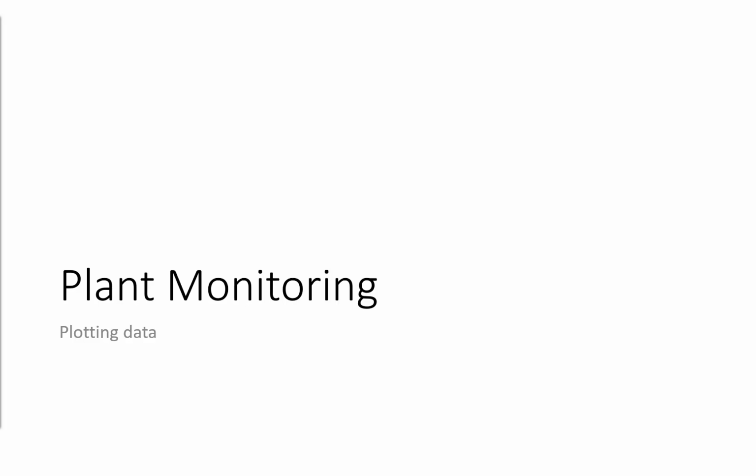So inside, we've got a little battery there. The idea of these batteries is that if you just leave them on and don't use the deep sleep functionality, this will survive about 17 hours. We then start turning on the deep sleep functionality. So inside these boards, they've got the ability to power down the radio, the ability to power down as many of its functions internally as is possible. And with a battery like this, you can achieve up to 6 months and sometimes beyond, depending on the temperature that the battery is inside. So in reality, you've got quite a powerful sensor there that you only need to change the battery once every 6 months. Now with these batteries, they're also rechargeable.